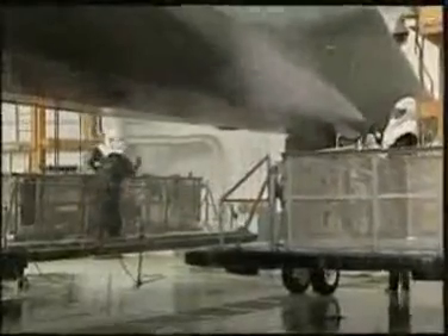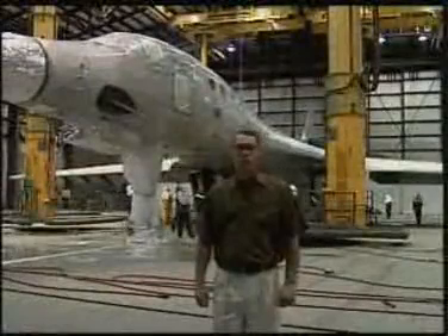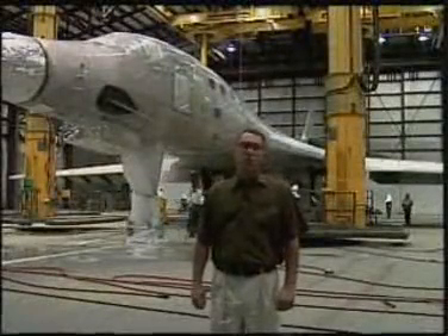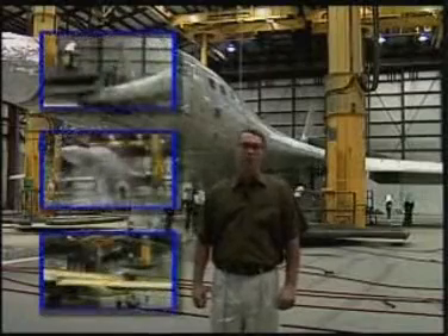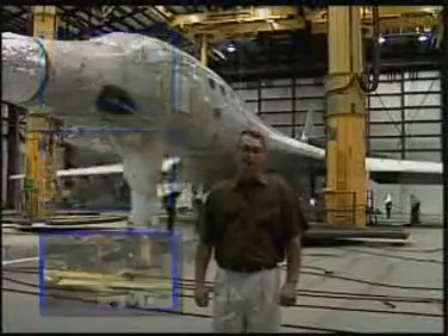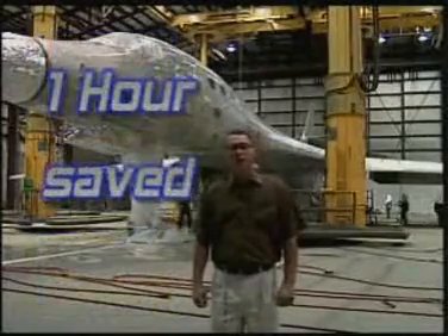Using the non-chromated pre-treatment system, or pre-coat, we've changed the traditional way we start the process. On this aircraft, we start on the upper surfaces, working our way down and out, then working the lower surfaces last. This prevents the pre-coat from drying on the surface or requiring us to go back and reapply pre-coat to areas previously worked. We work smaller areas, but when we're finished with an area, we don't have to go back. With the old process, we had to go over each area three different times with three different chemicals. The pre-coat process has saved us approximately one hour in production time.